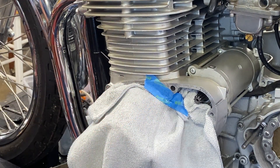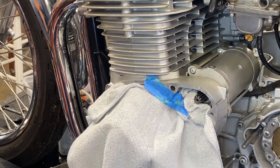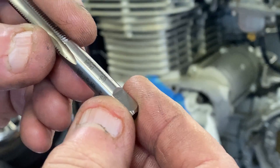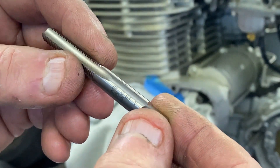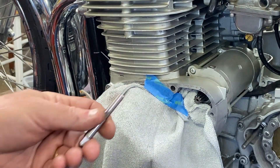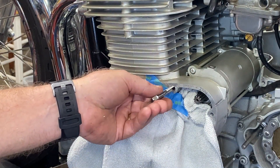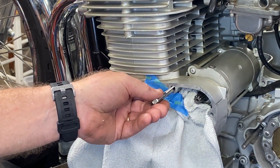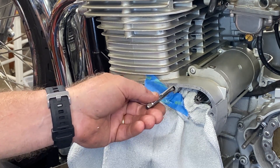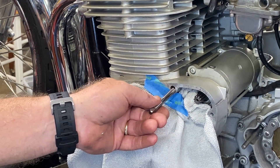Since we have that pin, which is really critical in this situation, I want to make sure it's not going to cut that out - otherwise I'm going to have to make a new pin. The other thing I want to do is take the helicoil tap and double verify - this is an M6 helicoil tap, M6 by 1. It's close, but it's not going to affect the counterbore area for the pin.